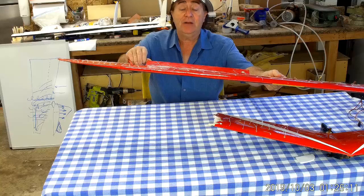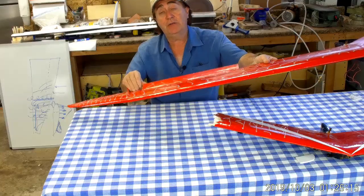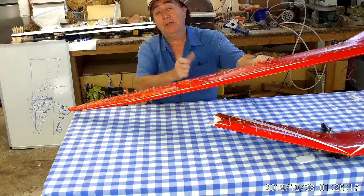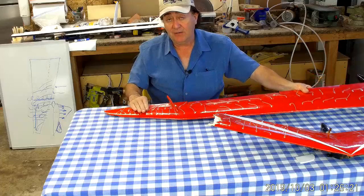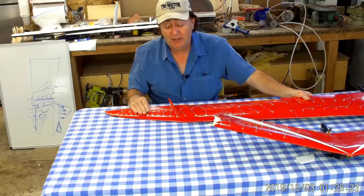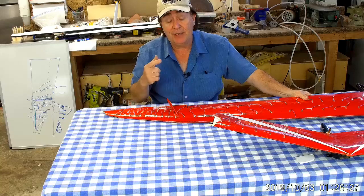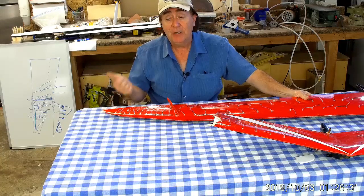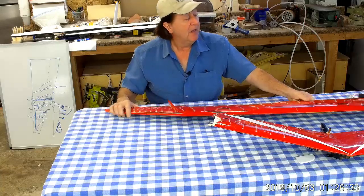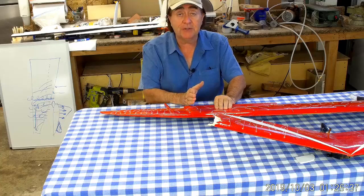So you hit the aileron to push yourself back into the thermal — now you have the control surface deflected up and you're shoving the flow off the wing. Even though it's only an aileron out at the tip, there will be flight configurations and modes where that aileron gets deflected up at just the wrong time, you push the flow out along the wingtip — bam, stall spin.